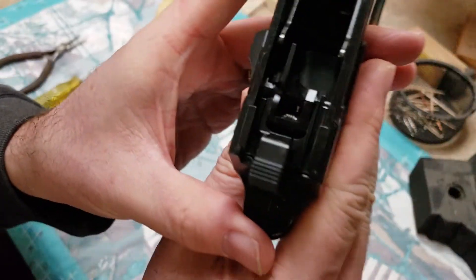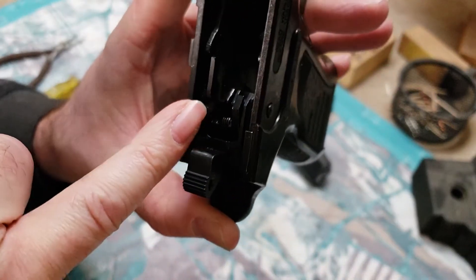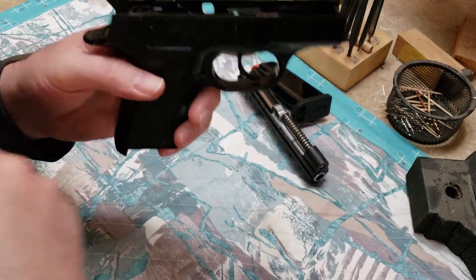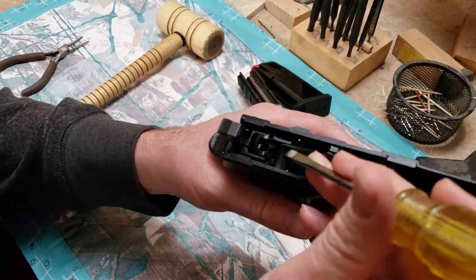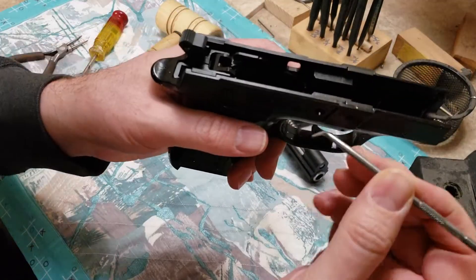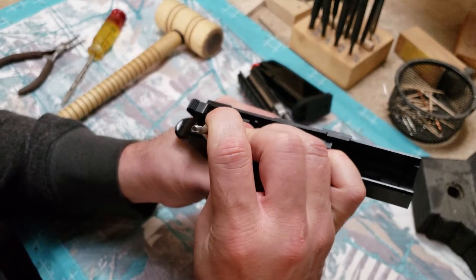If we look here in the frame, there's a long straight leg of that spring right here that's sticking up. I need to use something — I'm gonna try a flathead screwdriver, but I don't know if that's gonna work. No. So I think I'm gonna try a pick tool; I'm gonna get that spring up and then there's a detent notch.